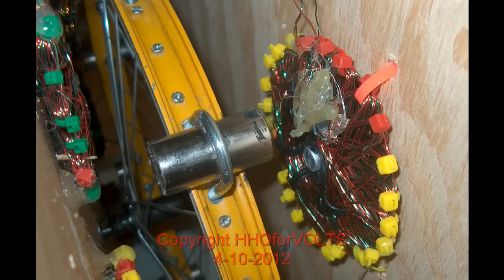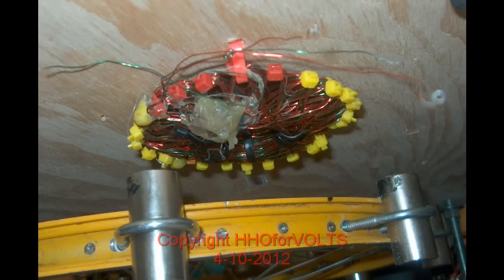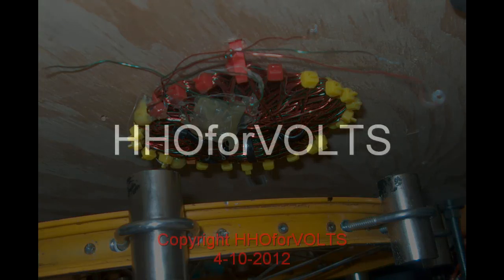You can see the other coils that are mounted on the bottom. Originally our design was to have 36 coils, top and bottom, but my backer — right when we were ready to get the prototype built — backed out, wasting a lot of money and my time. Now we come up to where you can see the spacing. It is critical how far through you push it, because you can get a cogging effect. You want to gently spin the wheel: it will slow down, and suddenly the magnet will speed up. We pick up quite a few RPMs and our current drops.